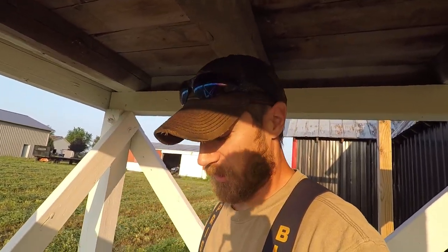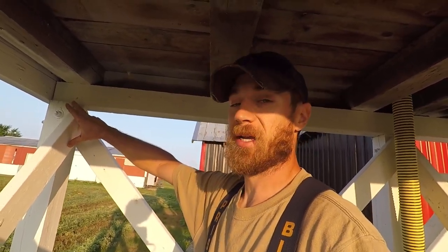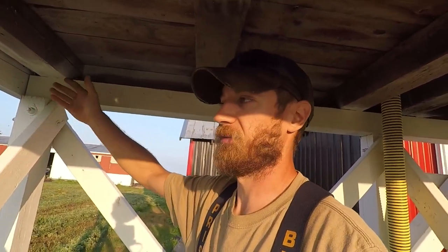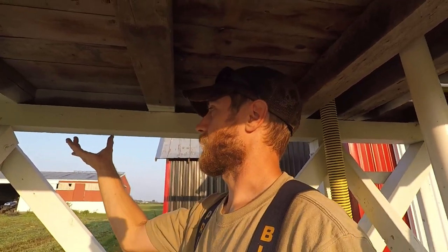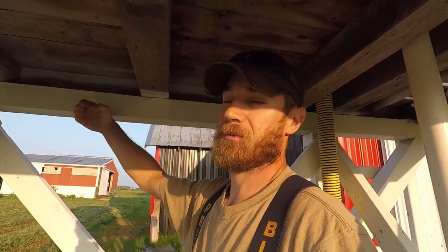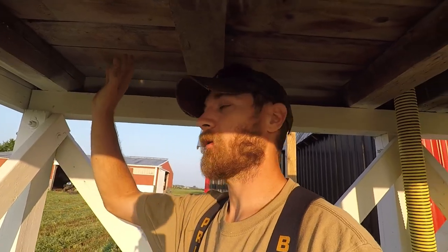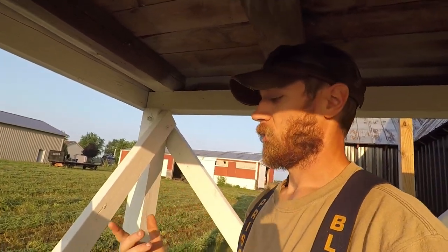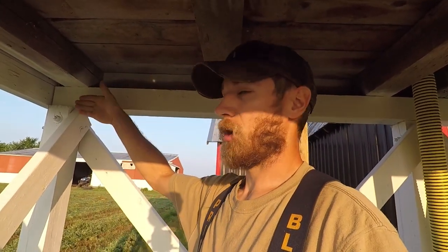There is not one bit of shear. And the major problem that I see with a lot of people building these towers is that they'll get their posts in the ground, they'll get some cross bracing on, but then they'll run the equivalent of a 2x8 right across these posts, and they'll nail it in, whether it's nails or screws, and they'll have 2 or 3, however many it may be. But then all of their joists that run across are either held in place with a U-bracket to that particular 2x8, or it's just resting on top of that 2x8. And what that effectively does is that all of the weight of what you put in here, all of that water, is gonna be transposed down onto that 2x8, but then that 2x8 is only held into its corner posts with a handful of nails or screws that, again, are very, very thin, and it's all in shear.